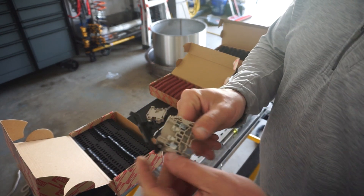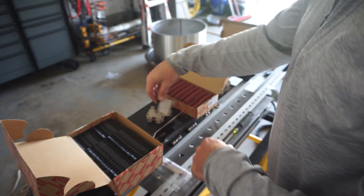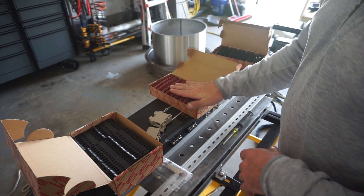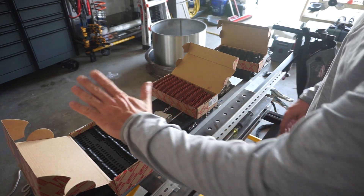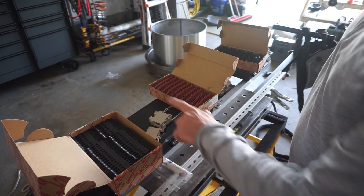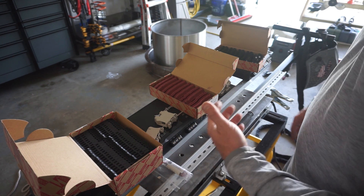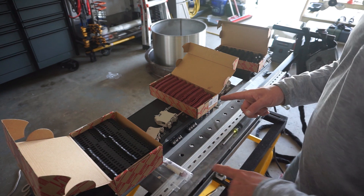So this is the setup — this is everything we're going to be using. We'll use barrel-style fuses on these connectors, they're going to link up in here and that's how these are going to stay fused. We have four-gauge connectors, these are all DIN rail mounted. We've got reds, we have blacks — these will delineate and separate all the speaker wires. This will go on the remote line because it is a power line, and the four-gauge will get separated out with a fusible link at the battery so that it protects everything going forward of that point.